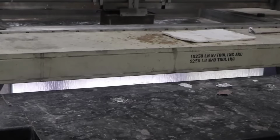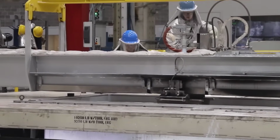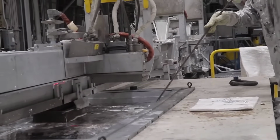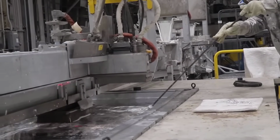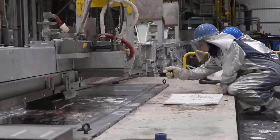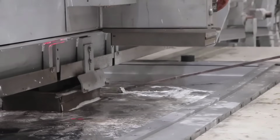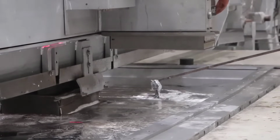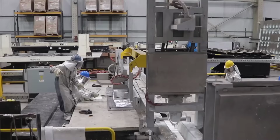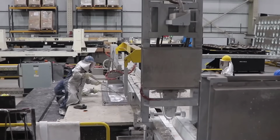The Wagstaff casting system, renowned for its cutting-edge vertical direct chill casting technology, stands as a testament to precision engineering. It operates in harmony with the holding furnace, ensuring the aluminum is cast with the utmost precision, resulting in superior quality products. The vertical direct chill casting technology facilitates controlled solidification from the bottom to the top of the mold, minimizing defects and ensuring a uniform microstructure, critical for high-quality aluminum products.